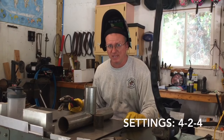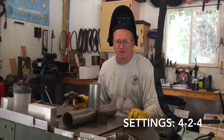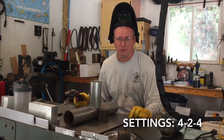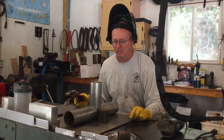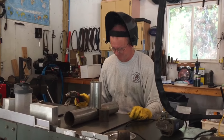I don't know if I've got my settings right. I've got my wire speed at 4. I've got my primary amperage at 2 and my secondary at 4. So a 424 is how I would call that. And we'll see if we need to make any adjustments. Right now, I'll just get a quick tack on there.